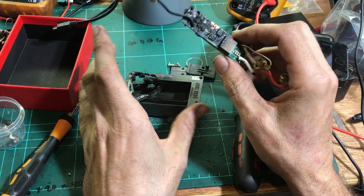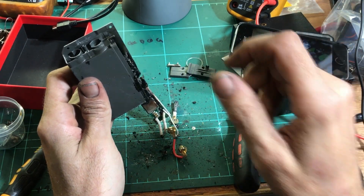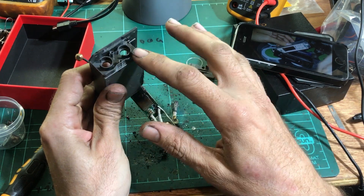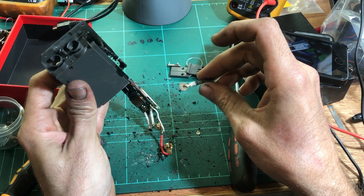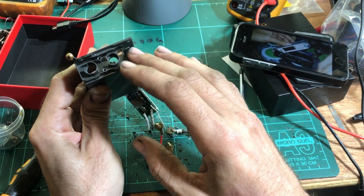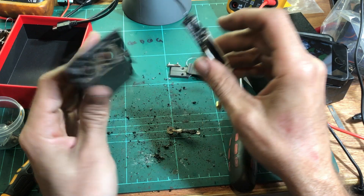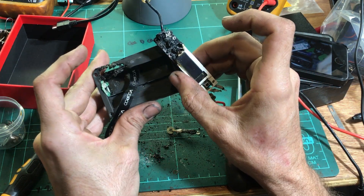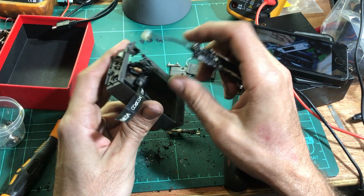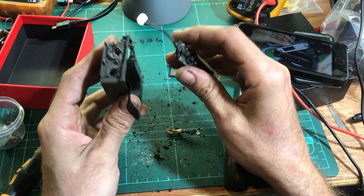Can't say for sure, but at this point it doesn't look like anything in the wiring has failed. It doesn't look like anything shorted to case — the contacts haven't popped out of place and shorted. All the wiring was still in good condition and intact apart from this positive wire that got completely toasted, but nothing had come apart, nothing shorted to case. So it doesn't look like it's really a preventable thing or an assembly error or something like that. I wish I had more ideas — like a smoking gun — to just point to something and say, 'They're putting these things in wrong' or 'This wire is getting in the wrong spot and getting shorted.' It doesn't look like that.